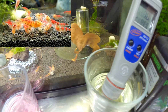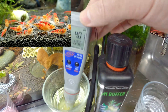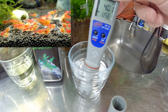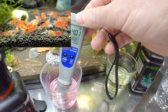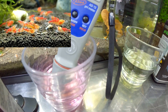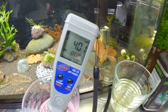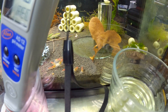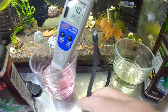As I said, I like to do this every so often because your calibration can go off. So I like to quickly dip this in here just to make sure you get some of the solution off, and then you put it in the 4.0 solution — like so. 4.0, and once this says ready it will be done.